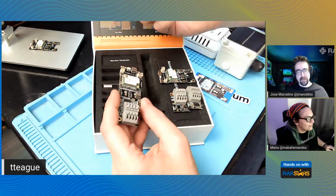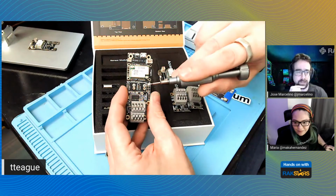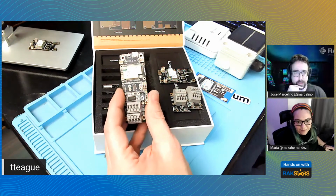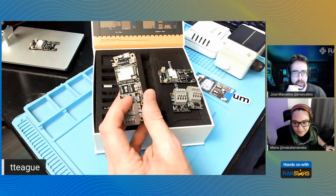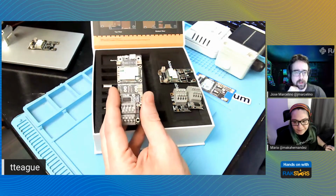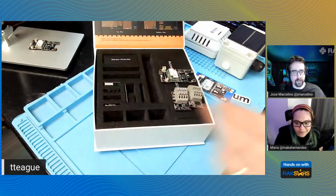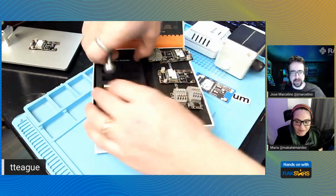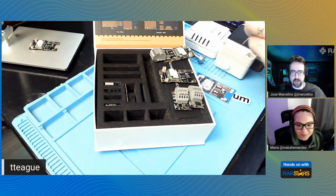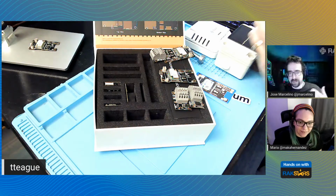However, what you can do is, if I want to cut the power off on any of these module connectors, I can do that. Correct? If I want to turn this off for low power mode, if I know I'm not going to be needing this until some particular event happens, I can absolutely just kill power and not even be sleeping that unit, not even be using that module at all. So you can turn them off. There's I/O for that, for all the modules. And same for the 12 volts. So if you're boosting, which uses a lot of power, you can also turn it off. So you can turn it on, get your reading from the sensor, then turn it off, and it goes into low power mode.